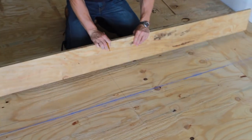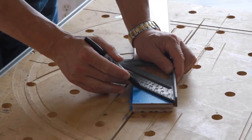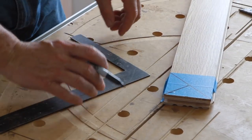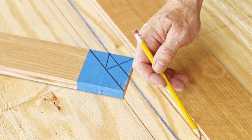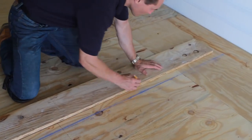Now it's time to lay out your working lines. You need a parallel line on either side of the center line to use as a guide as you lay each slat. To set their distance, use a rafter square to mark a 45-degree angle from the tip of one board, then flip the square over and draw another line from the opposite corner to intersect the first line — now you've got a capital T on your board. Make a line from the intersection of the T perpendicular out to the edge of the slab, then from that point draw a parallel line with the top of that T. This represents the center line you already have on the floor. Lay the board on the floor with that last line oriented right over the center line, then mark the floor at each corner of the board at several intervals. Use a straight edge to connect these points and you've got your working lines.